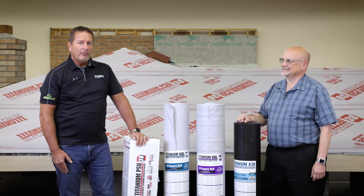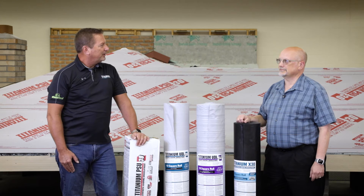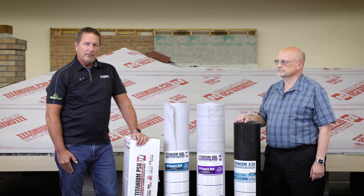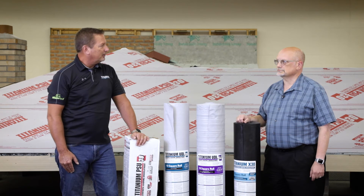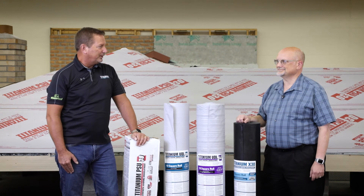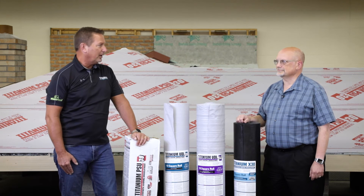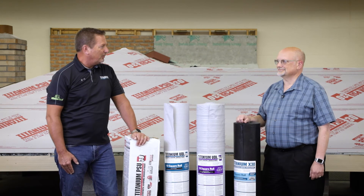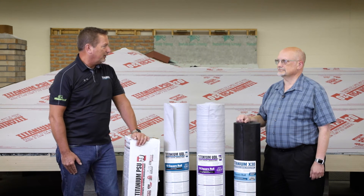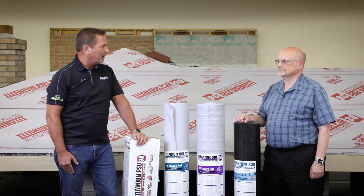Another aspect of the Florida Code that's a little different than the International Codes is it does address a re-roof situation where there's an existing layer of self-adhered underlayment on the deck. It basically stipulates that as long as the roof sheathing can be verified as far as nailing goes, you would still need to install another layer of approved underlayment over top of the existing self-adhered underlayment. One issue is that you wouldn't want to automatically install another layer of self-adhered over the existing layer because the surfaces aren't always compatible with each other.